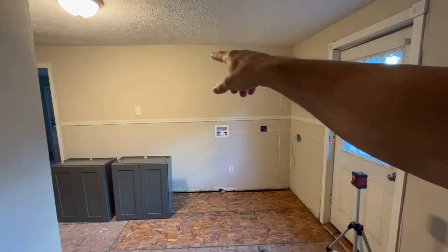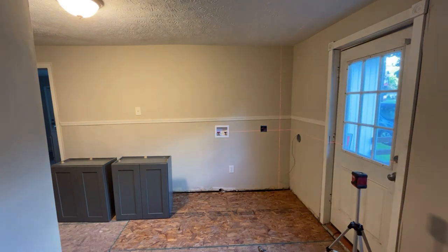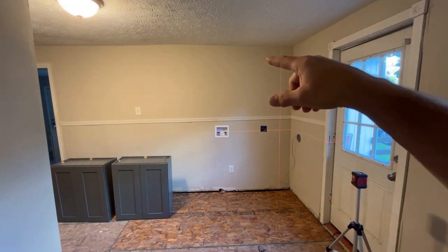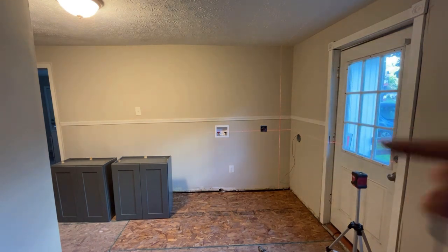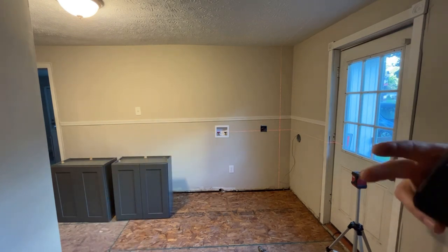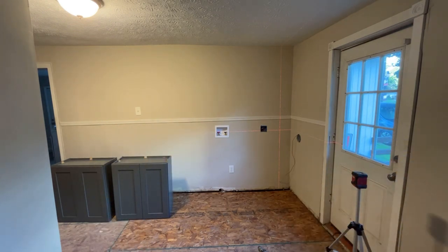I'll have to wait on the other one until the 3 inch filler comes, because there's no point in installing that 12 inch tall cabinet without the 3 inch filler, because I'll attach the filler to the cabinet before I put it up into place. And I'm going to end up taking the doors off of these to put these cabinets up. A, it's going to make it lighter, and B, I like to clamp one cabinet to the next cabinet with these clamps here so that I can screw the two faces together, which I'll show you all that.